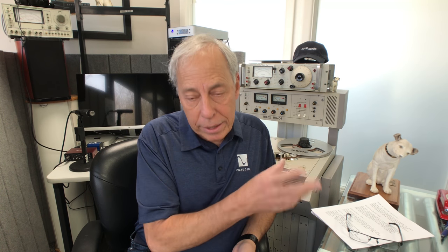The P20 has a 20 amp receptacle on it. Most aftermarket power cords and most receptacles in our homes are 15 amp, at least in this country. Because of that, there aren't a lot of 20 amp power cables and receptacles to plug them into. So one of the problems is that people have collections of high-end power cords that they won't be able to use on a 20 amp IEC connector — they'd have to buy a whole new set. And we don't even manufacture a 20 amp power cable, so there is that problem.